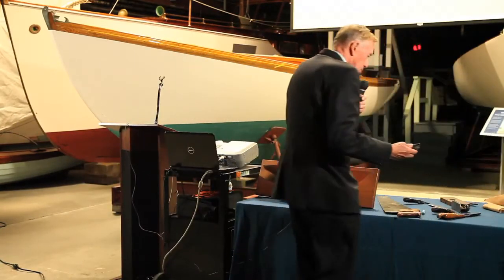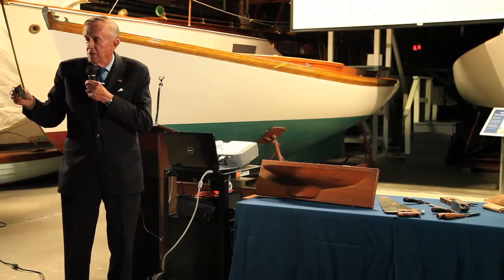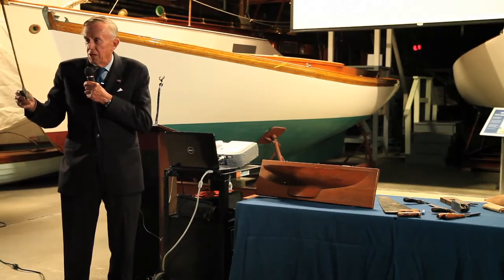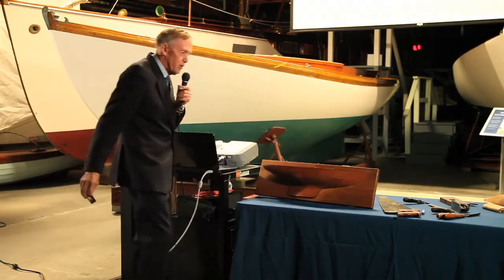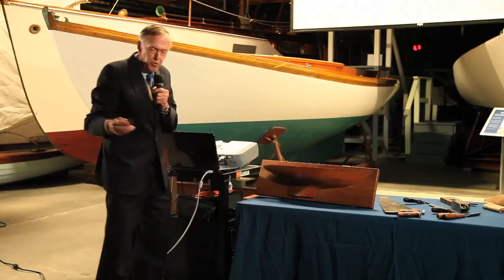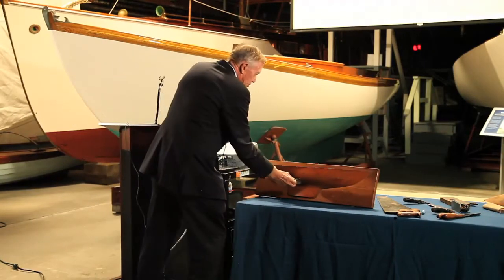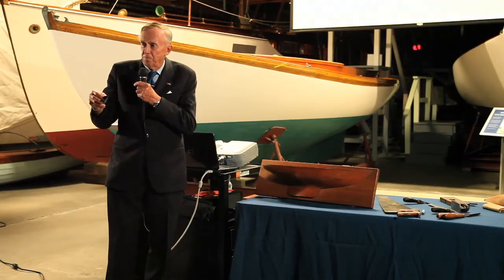In the latter stages we use these little Stanley planes — tiny ones. You used to be able to buy these for five cents. In the model room we've got a whole lot of them which Captain Nat shaped with different curves, which you could use particularly in planing the modest curves of the deck. He also has a lot shaped with a roundness that could be worked into hollow points. Because they're shaped to match the curvature of the hull, they're an important element in fairing — the blade takes off high points and misses low points, so you get closer and closer to a fair surface.